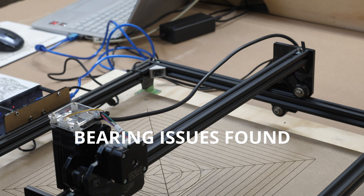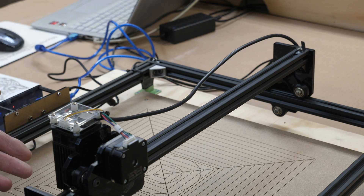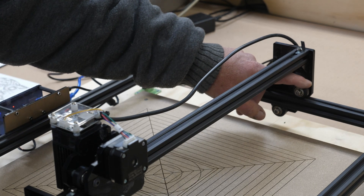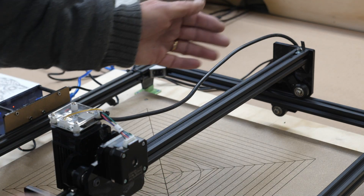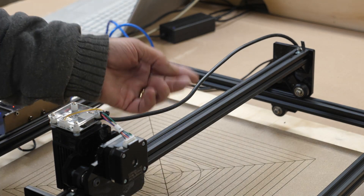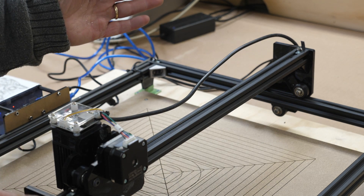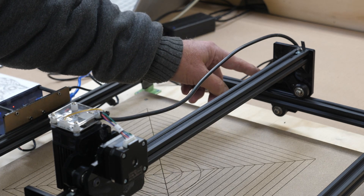When I was trying to frame at 390 by 320, it was hanging up bad and I couldn't figure out what was going on until I started moving it and could feel that these wheels right here, as they traveled on the extrusion, would hang and skid every once in a while. That would kick the gantry and cause it to stall. I took one of the wheels out and as I held and rotated it — it's a sealed bearing, so you can't lubricate it — it was like there was grit inside. I had to replace four out of the six wheels using ones from a 3D printer I had for parts.